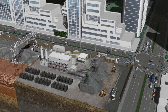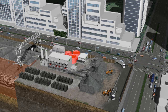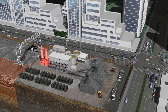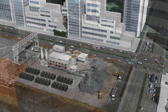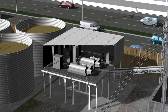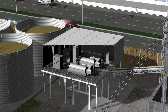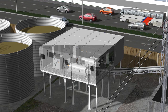Operating a separation plant requires further components. The storage tanks contain a supply of clean and unclean bentonite. They are used as a buffer for continuous operation. Bentonite supply silos and mixing systems guarantee a sufficient quantity of fresh suspension to allow for smooth tunneling. To further optimize the pump performance, decanter centrifuges can optionally be mounted downstream in order to separate microparticles as solid phase from the mobile phase. This allows to reduce wear and operating costs of the flushing and slurry circuit and to increase TBM performance.